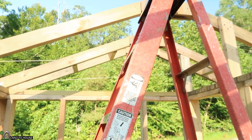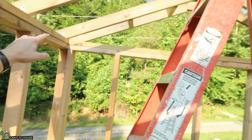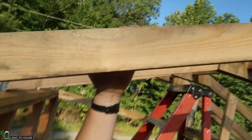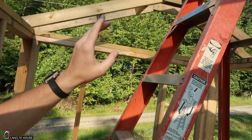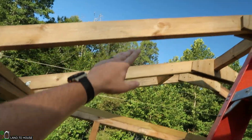Now remember, this is a playhouse we're building. I'm going to cut down the OSB into two-foot strips instead of having full four-foot sheets, because I don't feel like figuring out how to get those big sheets up here on top of this roof. What we're going to do is measure out the distance required to go from the last piece over here to halfway on this stud, then rip down two-foot pieces. I'll run the strips along here and offset — so the next piece will go from this end to this truss, and the smaller piece over there, staggering back and forth.